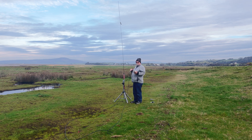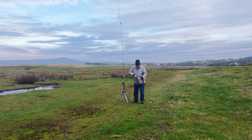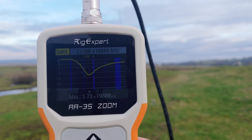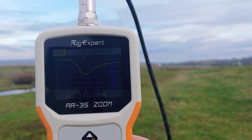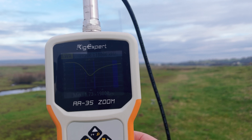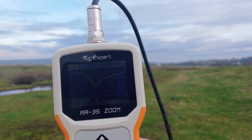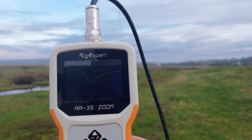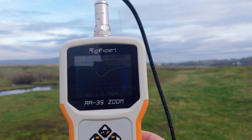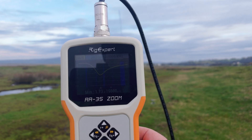With 17 metres being so high on the coil, I am struggling to get 15 metres tuned in. So what I'm going to do is the trick I did on 10 metres when it was ground mounted — take the whip off, fold the top section, and see where we get to. This is what I'm seeing with the coil in on 21 MHz, 15 metres. The best I can get it is 1.73 to 1 at 19,800. I'm not going to mess any more with that — that will probably tune. But if I want to use 15, I may have to add more radials, although the ground here is soaked with salt water, so I'm not sure what difference that would make. Or get a different length of whip for the higher bands. Let me take the coil out and see what it's like, both with the antenna full length and with it folded at the top.